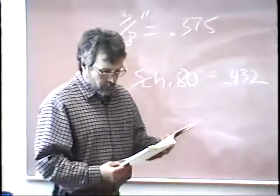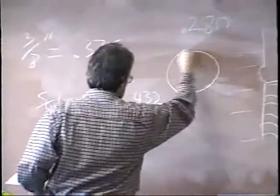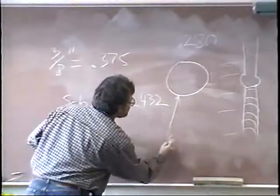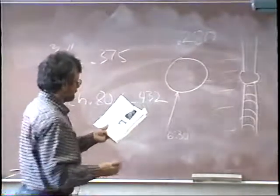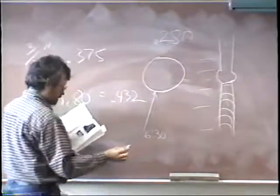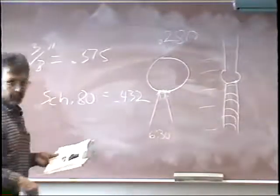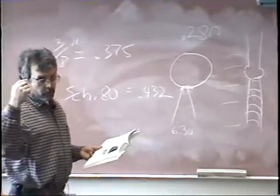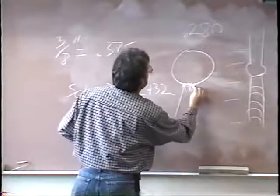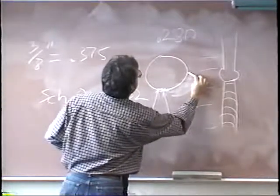Looking at figure 5.6, it shows a piece of pipe and shows that our weld was started at the 6:30 position, just a little bit beyond bottom dead center. The gentleman is using a 5 to 10 degree drag angle, and then comes up the pipe. Usually we will have our tacks right in here and we'll start right in the middle of the tack. Our tacks are going to be full penetration, ground and feathered. We start in the middle of the tack, burn through that tack before we reach the end of the pipe, lock your wrist so that your rod angle transitions to the push as you go up.